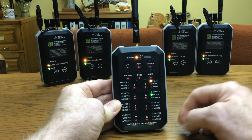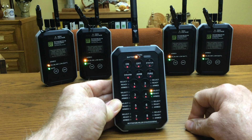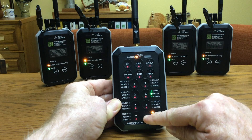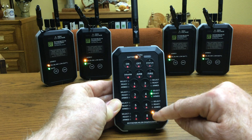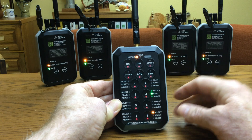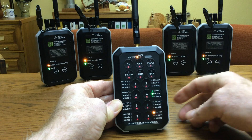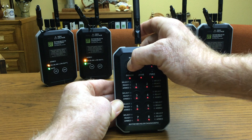I'm going to leave it enabled. If I push this again, you see the yellow select light on number one is blinking — that's the half-second programming. If I change it to two that would be one second, three is one and a half seconds, four is two seconds, five is two and a half seconds, six is three, seven is three and a half, and eight is four-second timing. I can change the on/off and the timing. When I'm done choosing, I hit the status button, the lights stop blinking, and that's locked in. Then I just turn it off and on.